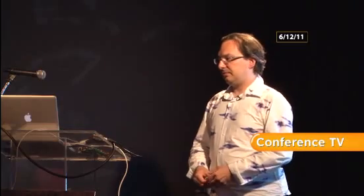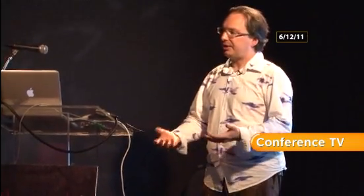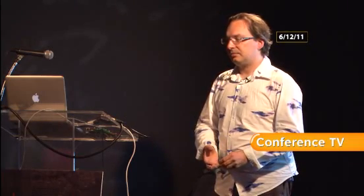So there's built-in code on the Arduino in addition to what you personally... Yeah. So what I've done with the Arduino is I've uploaded a library called Firmata, the standard Firmata library, which uses the Firmata protocol, which is based on MIDI. So it's sending little messages backwards and forwards saying, turn digital pin 5 on. So what's actually handling those messages on the Arduino side then? Like, Firmata is the messaging protocol, but does it also have the mapping of what those messages do?